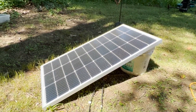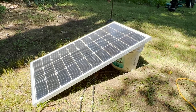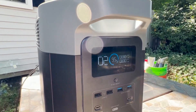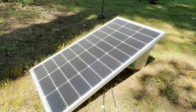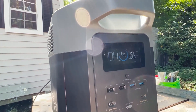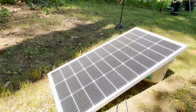That's why I call it solar for dummies — it's super easy to do. Obviously this is not an ideal setup but this is just for the sake of the video. Just to show what an obstruction looks like, I covered it with my hand — even though the whole thing isn't covered — and it's rocking zero watts. If I pull away, immediately back to 80. So you want to make sure everything's unobstructed, because even partial shading dropped it down to 40 or 30 watts. Always keep it clean and in as much sun as possible.